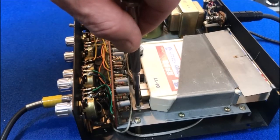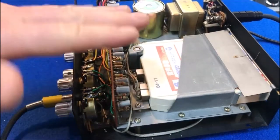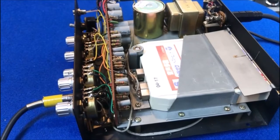Alright, there are three screws on this head assembly and you want to balance that out so it's right in the middle of the tape path, and you should get good sound out of your echo chamber. Good luck.